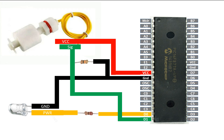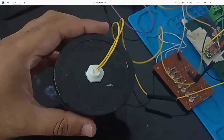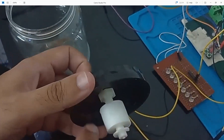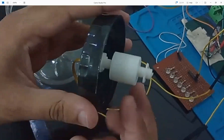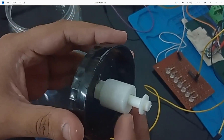In this way our P35 float switch and LED are both connected. I'm going to program this PIC so that whenever the float switch movable part hits the top — meaning there is water in the tank — the LED will turn on. For demonstration purposes I will be using a bucket. I drilled a hole in the cap, inserted the sensor from the bottom and screwed it from the top.